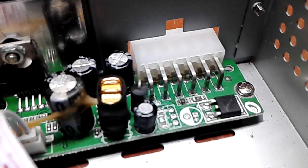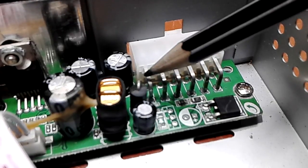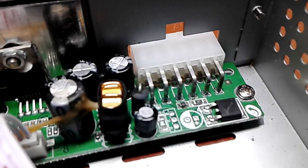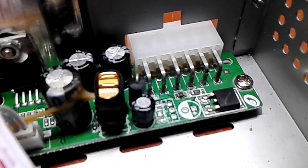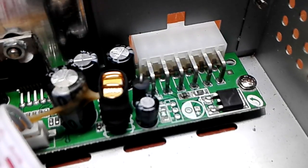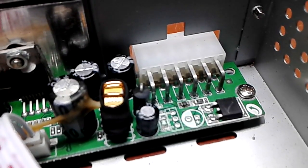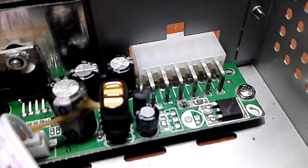And what is that anti-parallel configuration? Well, the cathode of it is connected to plus 12 volts from the battery. Not from the accessory, not from the ignition switch, the one that goes through the fuse to your battery. And that's the important bit. It must go through a fuse, because when this diode conducts, it will conduct a lot of current. And hopefully, if the fuse is there, and it is properly rated for the application, it will blow and everything is gonna be fine. Most likely this diode will be messed up, but it will save all the other stuff.